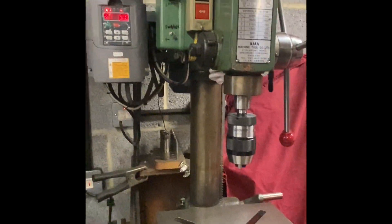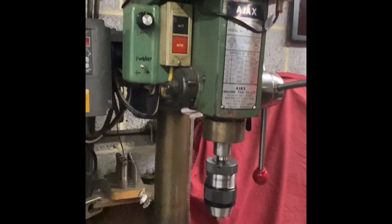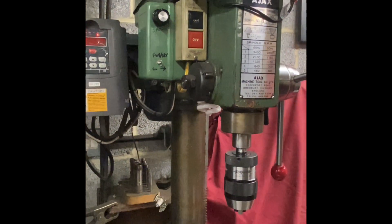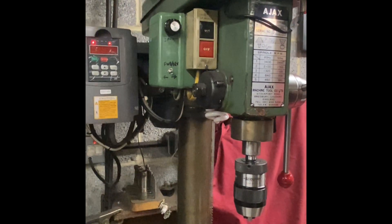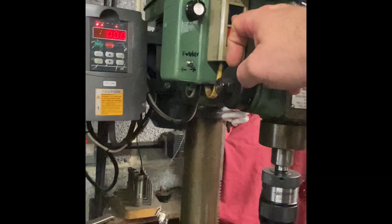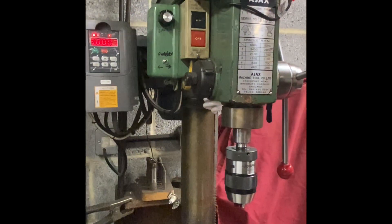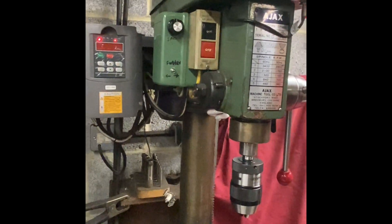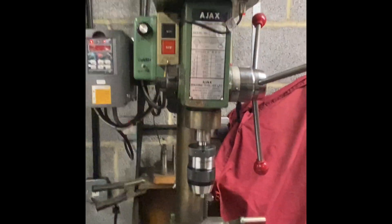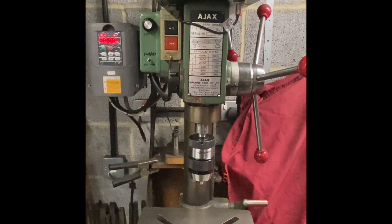The biggest benefit about running VFDs, especially now with the cost of electricity in the UK, is you minimise the energy that the motor's using. A variable frequency drive will only put the power in when you're applying the load, so effectively you save quite a bit on your operating costs. The other benefit is you don't get big in-rush currents when you start the motor, because I have it programmed to ramp the motor up over a few seconds. So you don't have that issue of an instantaneous high-capacitance load dropped on your electricity supply. Highly recommended. That's my pillar drill and my first machine tool review. If you've got any questions, please leave them below and I'll do my best to answer them. Thank you very much.